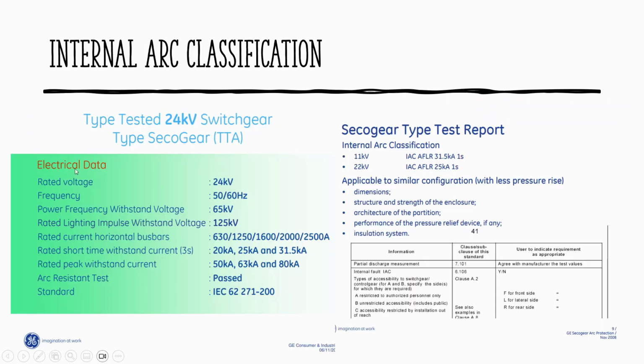So anyway, to carry on, if you look at this internal arc flash classification, why I'm sharing this one is because we are dealing with the switchboard every time we go to site. We have to understand what the switchboard is, and all of the things installed in it: the VT, CT, the protection relay. When you are on site, you are sometimes dealing with an energized board, on the other side, working on the front or at your back, energized. So we have to understand that environment.